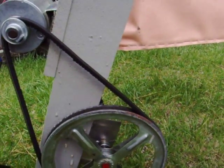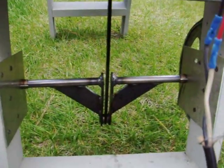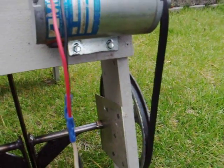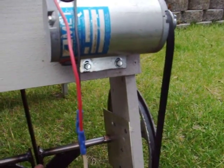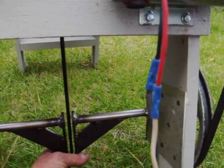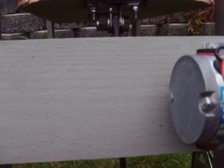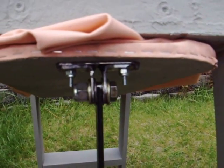And then I used a big pulley from a Door King gate operator and a piece of 5/8 bar that I made my crankshaft out of. I put all this together, drilled holes here so the crankshaft bar would go through these, and then welded it, and then cut out the center. That kept everything true. And then used a Genie draw arm from a garage door for the arm so it goes up. And then just fabricated a catch up there.